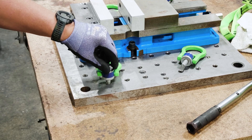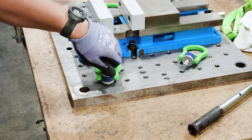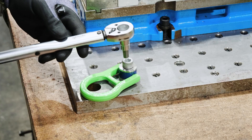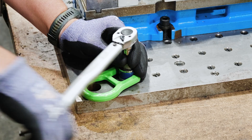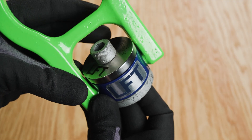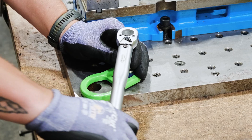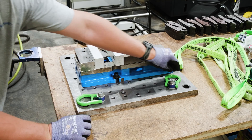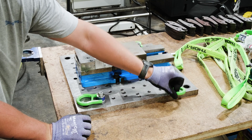Once the surface is ready, lay the bail flat and begin to thread the torque bolt until it is hand tight. Grab your torque wrench and refer to the recommended torque value for the correct pounds of force per foot needed for the swivel hoist ring. You can find the recommended torque values on the swivel hoist ring itself and in the spec sheet on its respective product page. Begin carefully torquing the bolt until the torque wrench reaches the recommended torque value. After installation, always check that the ring rotates and pivots freely in all directions. You're now ready to attach and lift the object using the LFT swivel hoist rings.